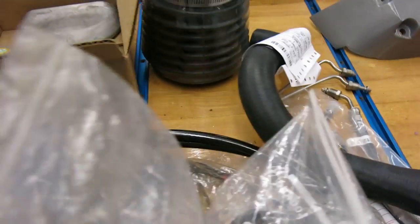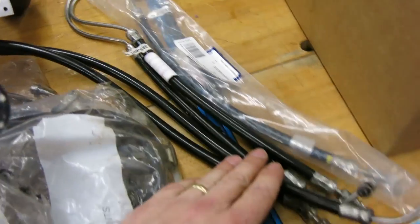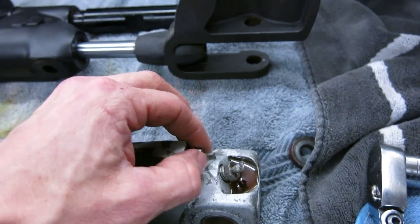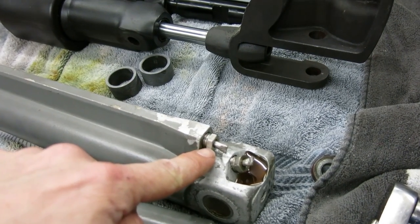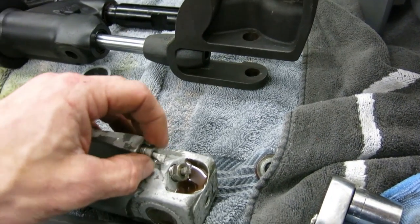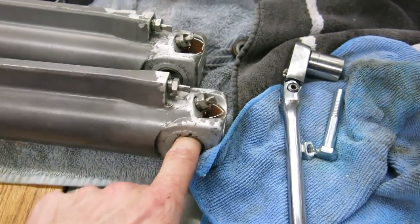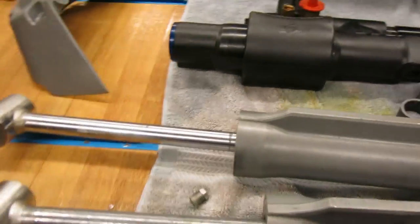I also ordered some new hydraulic hoses because the corrosion was really bad on the fittings. They were all stuck in there really well and there was no way to get enough purchase on the heads to get them undone. The only way was to get a six-point socket on the end of them, and the only way to do that was to cut them off. That wasn't too bad because I had used so much heat to get the pin out that I had actually melted the end of some of those hoses — unfortunate but necessary.